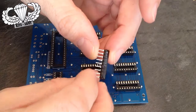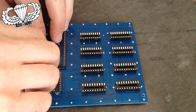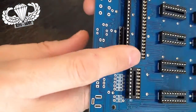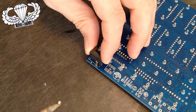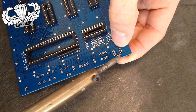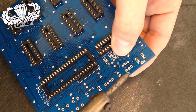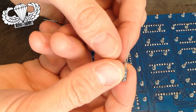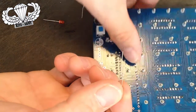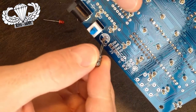Now I need to add a bunch of equipment to the board. First you're going to put on your sockets. Here's a resistor — it gets put next to the 40-pin socket. The next thing you'll be adding is the connector for the voltage — this is a 5-volt connector. It takes a little bit of effort to connect this, so just take your time. There's a switch here that has six legs that need to be soldered to the board. Here's a capacitor — the longer leg is positive and the shorter leg is negative. You can see the negative side goes to the ones with stripes on it and there's a little positive symbol right there.